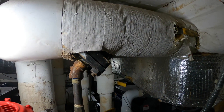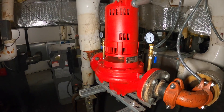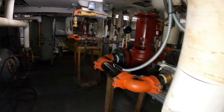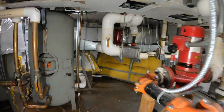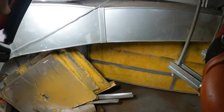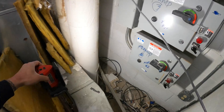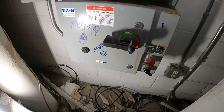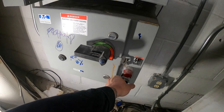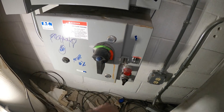The pump is currently spinning — it's on and runs all the time. Let's go ahead and go to the motor starters and turn this thing off. It's going to be pump number one — off. Lockout, tag out.